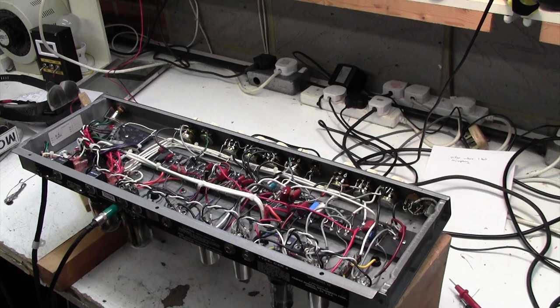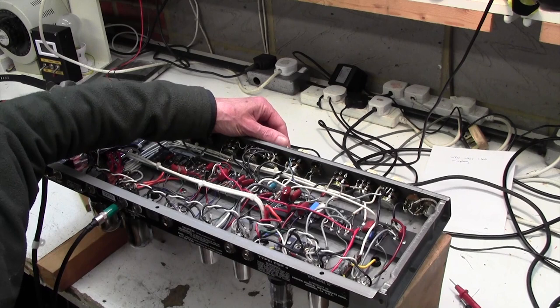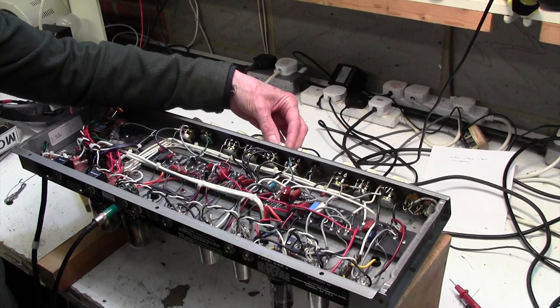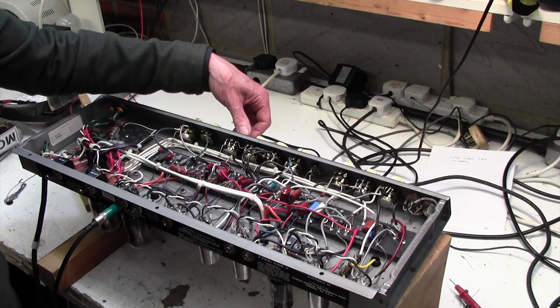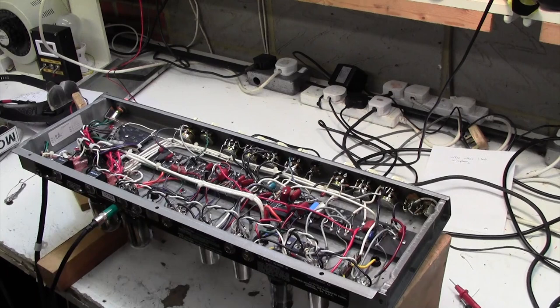Because if you remember, our tone controls affected the sound of that noise. Let's see if that's still the case. It was the treble particularly, so I'm going to turn the speaker up again. Yeah. Well, there's a horrible hum there which has come from nowhere. It might be the reverb actually, let me just... Yes, that's the reverb not connected. Right, so turning the reverb down.